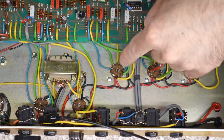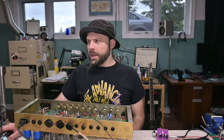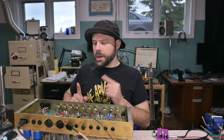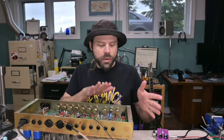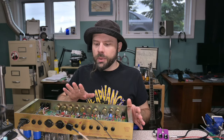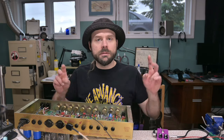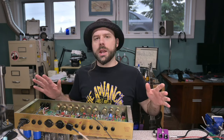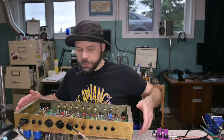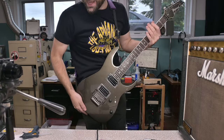This amp likes to hold some latent voltage — 477 volts, so be careful working on it. If we put a 1 meg resistor here, voltage stays at 477. 477 divided by one million ohms is very low dissipation — about 0.4 milliamps, times 477V that's about a quarter watt. Maybe a 470k would work. We're not going to worry about it right now. Let's get things glued down. I've glued down some of my capacitors. Now I need to point out that tube position V3 — specifically V4a in the schematic — is very susceptible to noise. A brand new Mullard CV4004 was humming like crazy, so I put in an Electro-Harmonix 7025, which is the designation for a low-noise 12AX7, and it's quiet now.